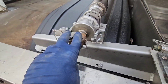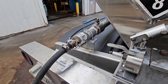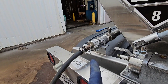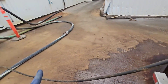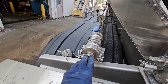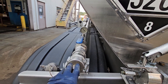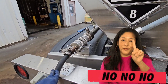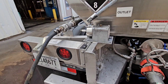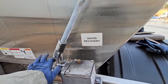All this is basically this cap right here that I had drilled out and had a Chicago fitting welded into it. Now, I can hook up air down here without having to climb the top. Because otherwise, if I didn't have that fitting, I'd have to climb up to the top of the trailer or run this airline all the way to the front of the trailer to hook up. This saves you time. And, this is how you can pressurize a trailer from the bottom of the trailer. Anything to keep from having to go up top is good because some plants won't allow you up on top of the trailer.